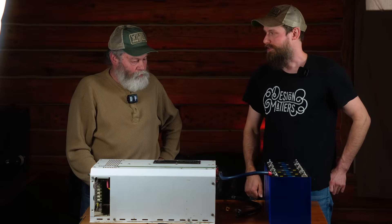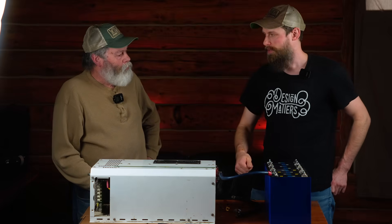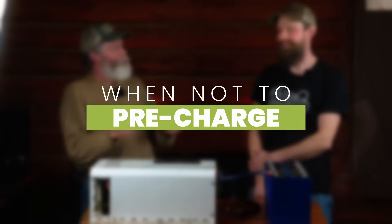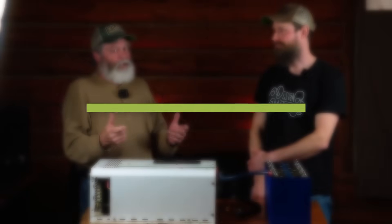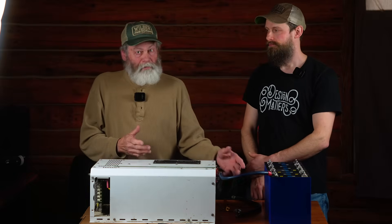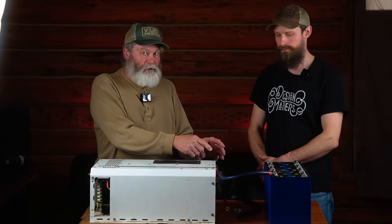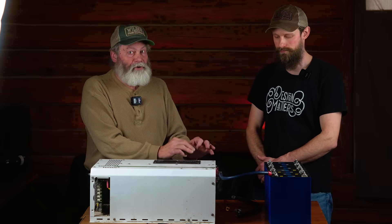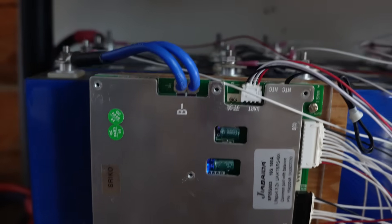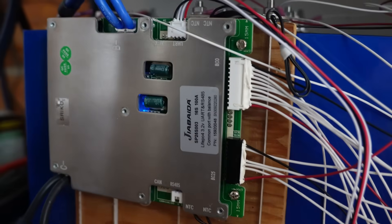The light bulb is very safe and easy. The pencil could be a good one, and the resistor is good to have on hand as a backup. There is one case where you don't have to do this at all, and that comes down to your BMS. If you need to do this manually, it's because you have a BMS that does not have pre-charge resistor circuitry built into it. The ones we use are the JBDs — very durable, very good BMSs — but they don't have it built in.